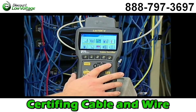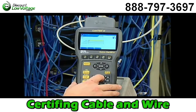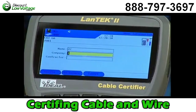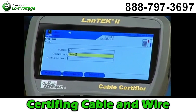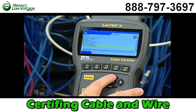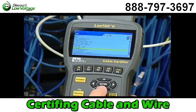Starting with user preferences, you can enter user information into these fields to indicate the operator, project, and owner information. This information is added to each test but can also be changed on the computer using Ideal's IDC reporting software. Auto test preferences is the next selection—select the available options, the help button for further explanation, or press Enter when complete. You can also adjust the backlight brightness, timeout options for the display, measurement units, or date and time formatting.